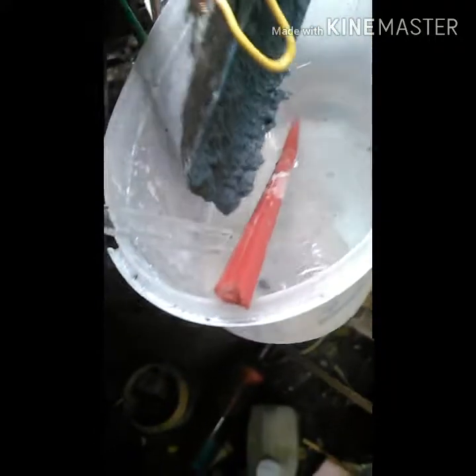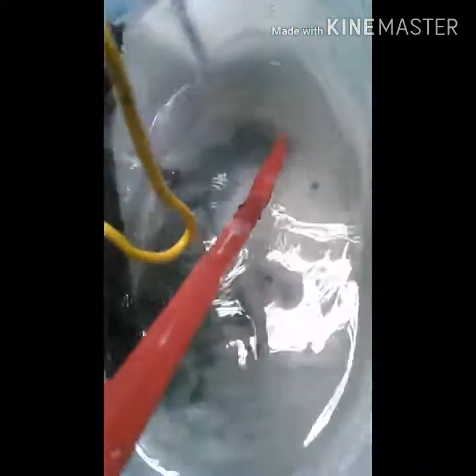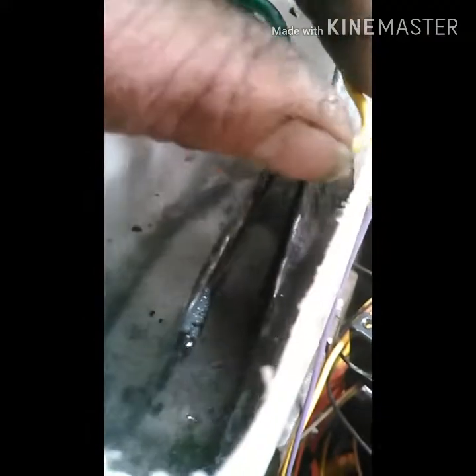So then what you do is — this is just a little water dish I have with regular water in it — and it just scrapes right off. And then once you're done scraping it, just throw it back in and start all over again. I find that the way I'm doing this, it pretty much will go forever until your anode's completely dissolved — which visually, after getting maybe a couple ounces of powder, I still can't even visually see a difference. Something you also want to do is keep your anode and your cathode as close together as possible. It seems to work a lot better — a lot faster — when they're close.